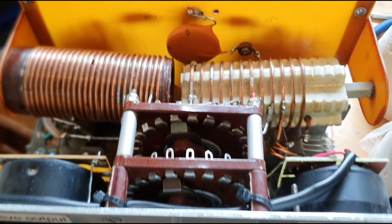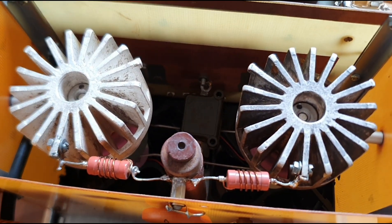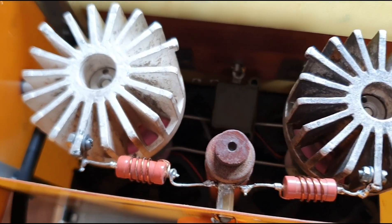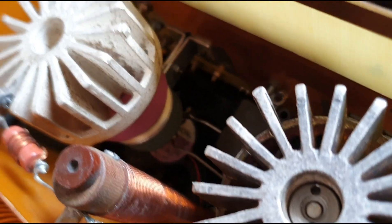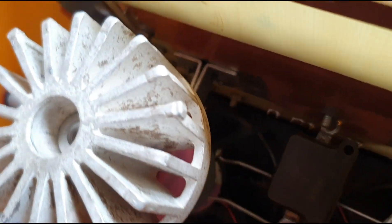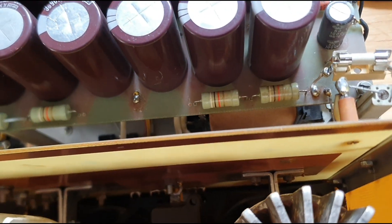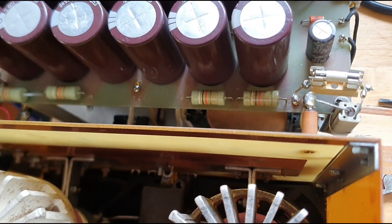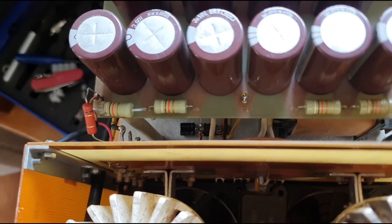Just got to tighten up all the clamps and fit the heat sink on top of this one, then connect up the heating element — going okay so far. The first one is back in. You can see above the fan there's a ring where the wire rail connects — that's what I've just soldered on to the bottom of the ceramic valve, which is now sitting in fully clamped and tightened with the heat sink back in place. I've also reconnected the heater and soldered it back to the lug. Just got to completely repeat the same process for the second valve.